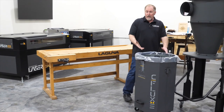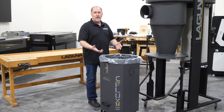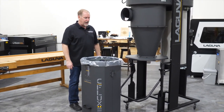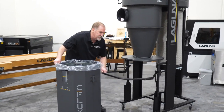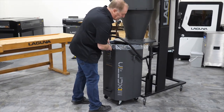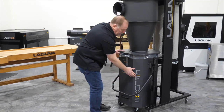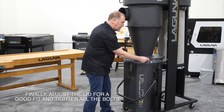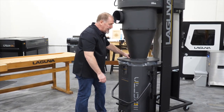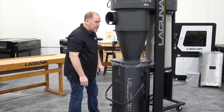Simply lower the unit into the drum and fold the bag over the top edge of the drum. The drum liner is designed to hold the bag in place so that the cyclone doesn't suck it up into the collection drum, and it can also be easily lifted out of a drum full of sawdust using the enclosed rubber lined handles. This drum can be used both with and without a bag — if you choose without, since you've sealed the drum, just grab the handles and dump out the dust, though you'll likely get dust all over you which is one reason to use the bag. To insert it in the machine, lift the handle, slide it into place — this is a test fit to make sure our adjustments are okay. Look for the little handles on the side to engage the pins and lower the handle, which raises the drum to the upward position. Now adjust the lid by rotating it, then tighten down the nuts and bolts around the lid once the adjustments are correct.